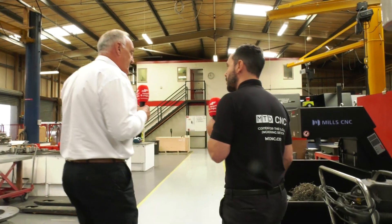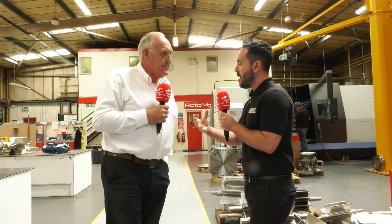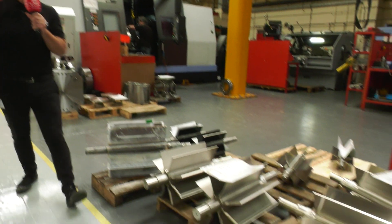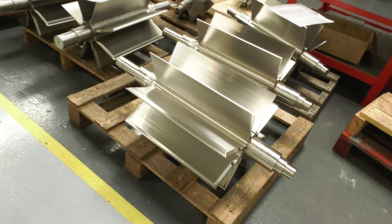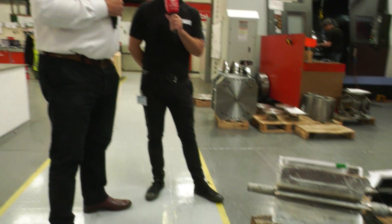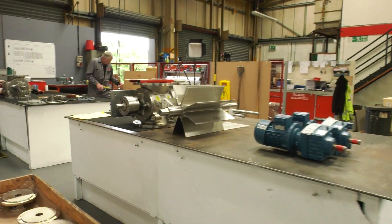The main advantages of bringing this work onto CNC machines — is it achieving a stable process, or also the time and operational savings? There are operational savings with modern equipment like probing that makes setup much quicker, and new machines simply perform better. Skilled labour on manual machines is also more and more difficult to find. As we grow and throughput increases, we need to speed things up — the next step is looking at offline programming, programming in the office. It's always a balance between finding the right skills and the right equipment.